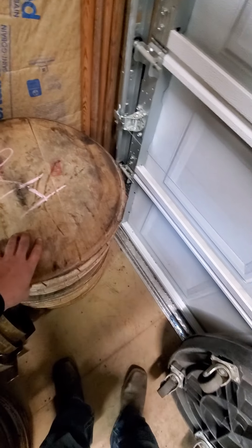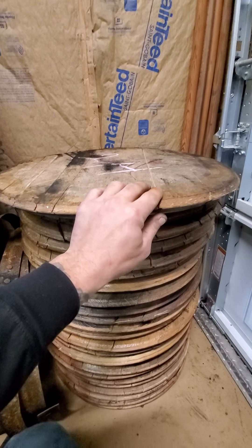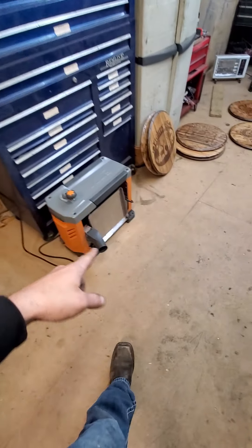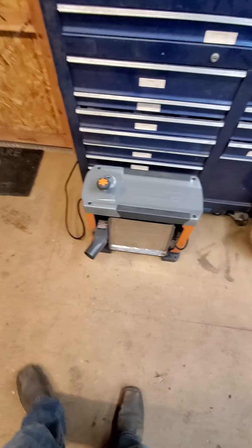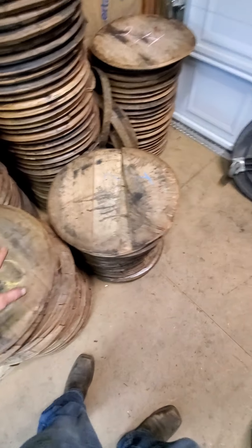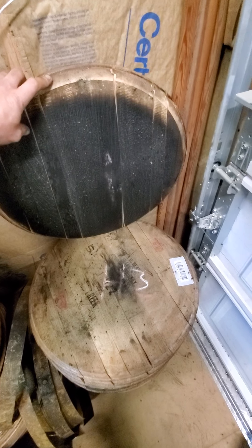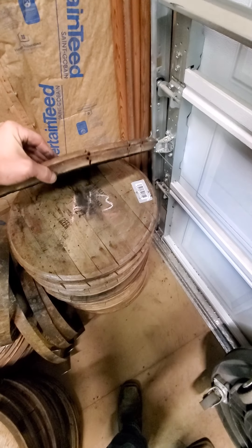The first thing I do is get my lid. This one's pretty nice and flat, but they're not always like that. Now that I've made a little bit of money, I'll split them in half — which you don't actually have to break them since they're tongue and groove — and run them through a planer. I don't take off a whole lot, just enough to get the main surface cleaned up so I don't have to do so much sanding. I only plane the front. If you try to plane the backs there are going to be unlevel edges, and if you start planing both sides you'll end up with about a half-inch piece of wood. They start out at an inch and a quarter.